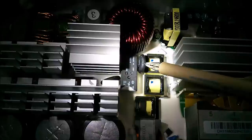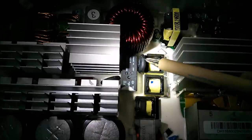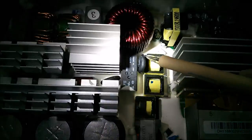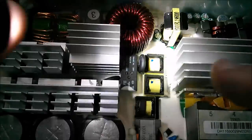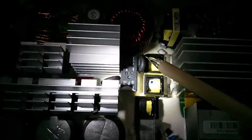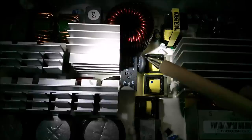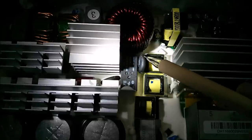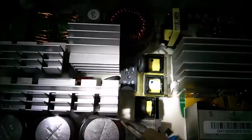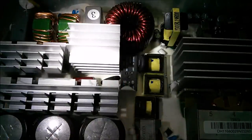These are marked 5-15D: normally 5 ohms when cool, the 15D indicating 15 mm diameter. As they warm up they go very close to zero ohms, so they're designed to limit the initial inrush current — most of which goes into these big capacitors. Then they act as pretty much link wire once warm, so you can get the maximum current through without a huge inrush current damaging the input components.